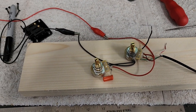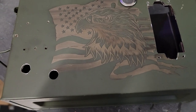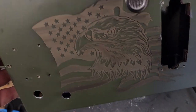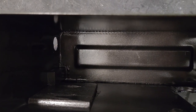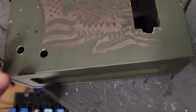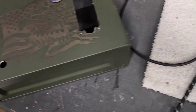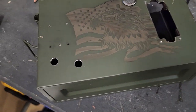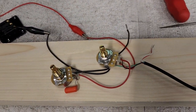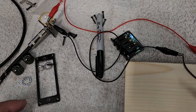I said I would only show some unique things. Now these cans, at least in my experience, have everything cut out, ready to rock and roll. But there's really not enough room to get inside here and try to solder these pots together. On a cigar box guitar, I would put the pots in the lid, flip the lid open and solder everything right there in the box. I can't solder inside of that can — there's just not enough room. So I have soldered everything out here, and everything will fit through the pickup opening on the box, except for the jack.